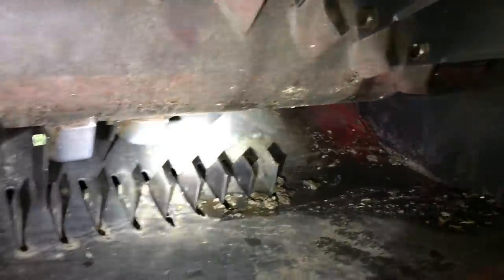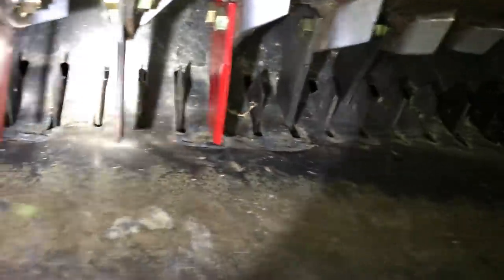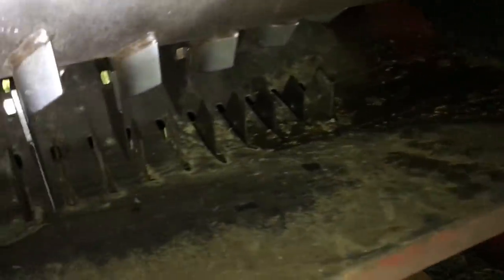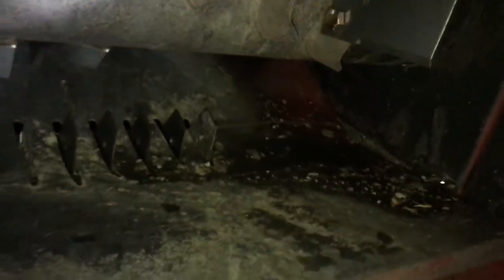Here we are in the back of the combine. I got all my stationary knives in — actually my wife did some of that. I took that plate out, she worked on the outside. I got all the fixing done in between the stationary knives and all the knives in my rotor for the chopper. I got them in but not fully tightened yet — I wanted to make sure I didn't have any clearance problems first. There's a weld right there that's a little high and some plates aren't exactly flat. It all spins free — it's a mean straw chopping machine in here.